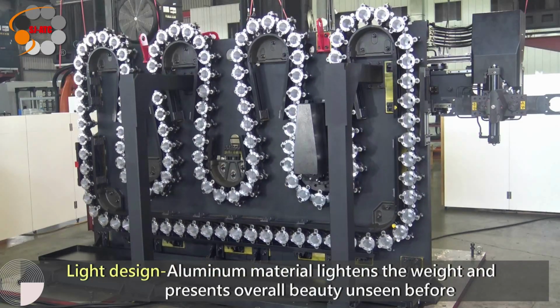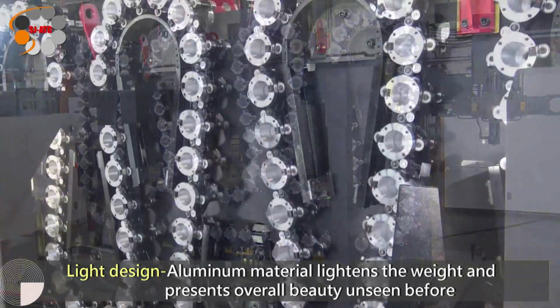And the dimensions, you've actually made this smaller and more ergonomic. So how have you done this? The chain can be arranged on the magazine in many ways. However, in traditional design, because the resistance is too high, you cannot bend it too much. But due to the low resistance of the new design chain, it can roll on the plates and it can be operated much more easily than the original design. So even if you go a very serpentine way, it can still operate well. So this is how we save the footprint and save the material of the main structure.